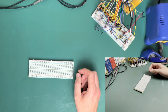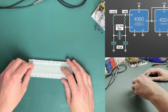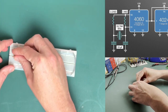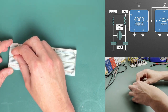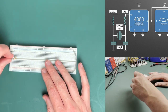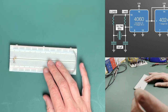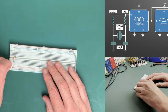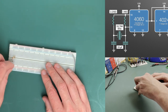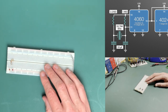So let's start with some of the circuit for our crystal, and what we'll do first is just pop some of these resistors in. That's resistor one, and then that's the biasing resistor. Crystal comes in here - that can obviously be put in either direction. And then finally we've got the capacitors down to the negative rail. Okay, that's the main bits of the components there.